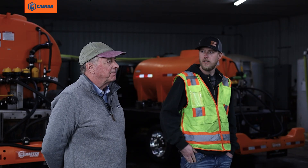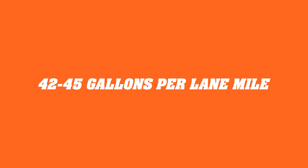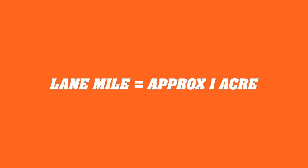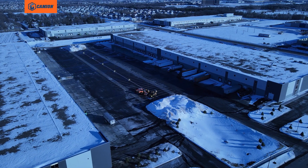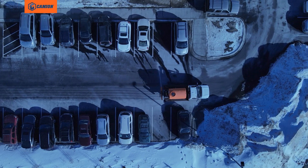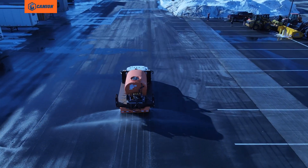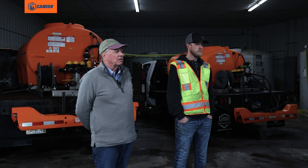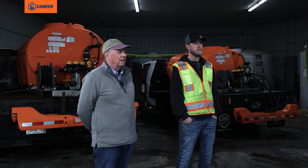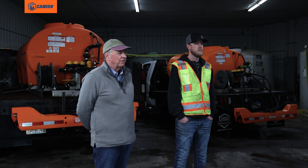Basically, we're using between 42 and 45 gallons a lane mile. A lane mile is approximately one acre, plus or minus a few thousand square feet. When we go into a facility, we're putting down about a 12 to 13 foot band of brine. We have some clients that want us curb to curb, but generally we're just doing lane application rates for pre-treating.